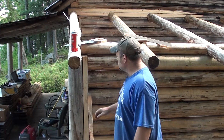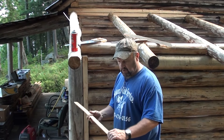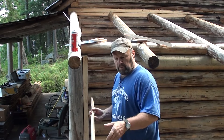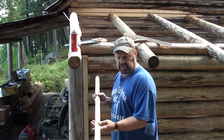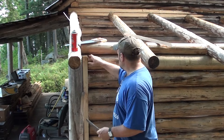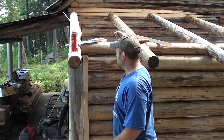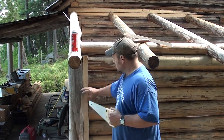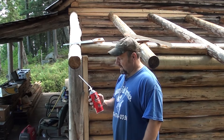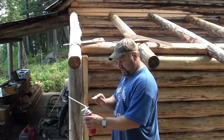There are different ways you can fill in between your logs. What I do is just take inch boards — my dad actually did these on his table saw — you put your blade at 45 degrees, run the board through to get the angle, then flip it over and do the same thing, so you end up with these little triangle pieces. All you really need is a chisel to knock off any high spots, knots, whatever. A sharp handsaw cuts these boards really easy.